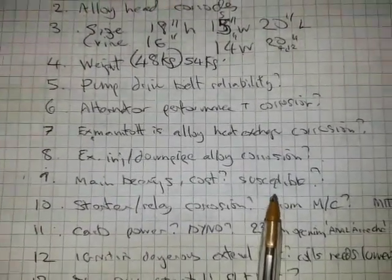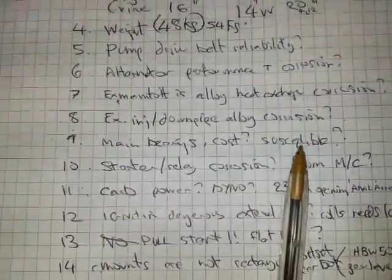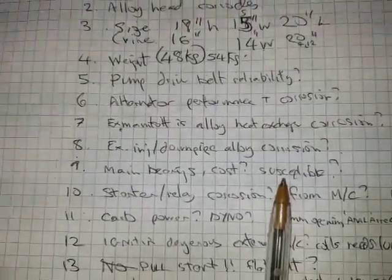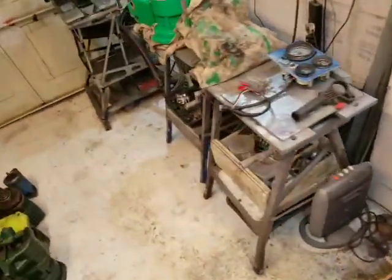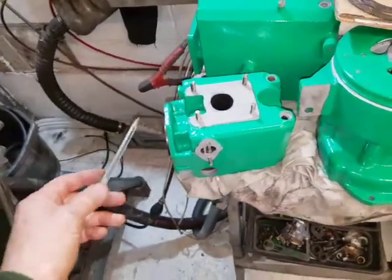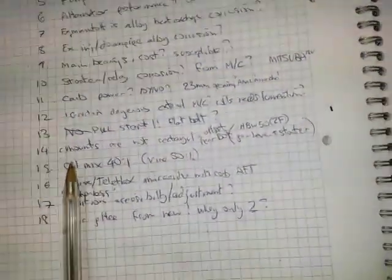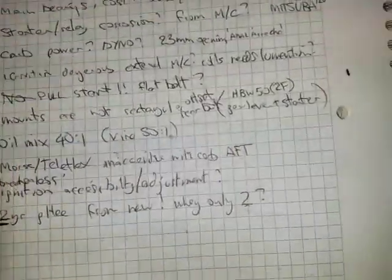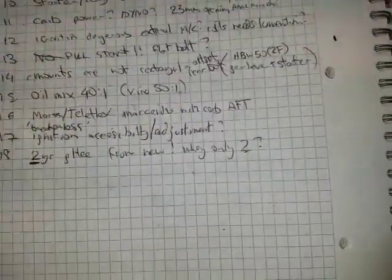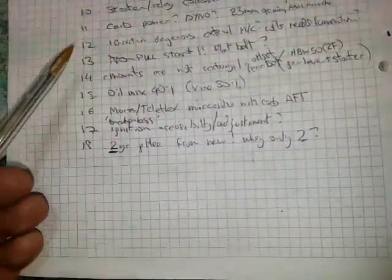So that's something a Vire can't do, because a Vire doesn't have a cylinder fault, but if it did have a leak, I've never heard of this, but if a Vire had a crack in the cylinder wall on the inside and it pumped it into the cavity, the engine would just stop because there's only one cylinder, and then you wouldn't rot out your main bearings slowly over hours and hours of use not knowing. But this is one of the problems with twins. They keep going if they've got a cylinder fault, but that can start pumping salt water all over the place.